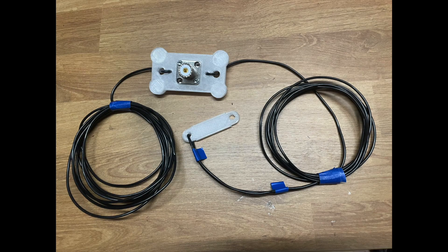It was fine on the SWR, but it wasn't working very well — pretty much the same as the HF antenna, which isn't really made for the job. So I was a bit surprised there. This morning I built a half-wave dipole and put that up. The bottom is actually stapled to the grass and the top is around about 16 feet up to a balcony. It didn't take long to build and didn't cost much money — just a few bits I had hanging around.